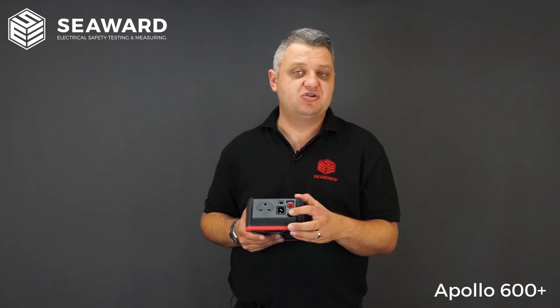The instrument will cover all requirements in the 4th edition IET code of practice, including fixed appliances. On the top we have the socket for your test probe, and the second socket is dual purpose — it can be used to charge the instrument or for leakage tests plugged into the mains. It also comes with two probes, so if you come across fixed appliances you can use two probes for your point-to-point test.